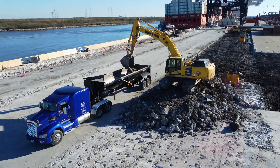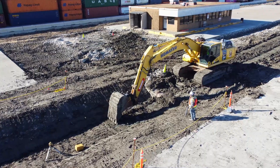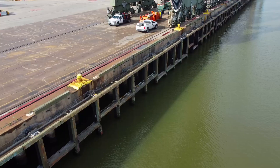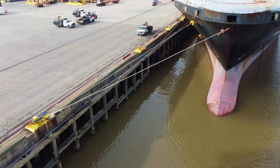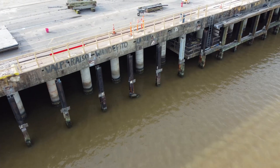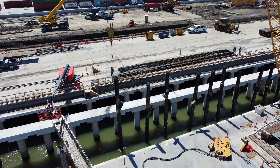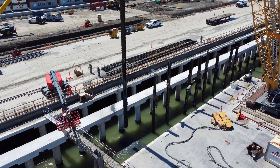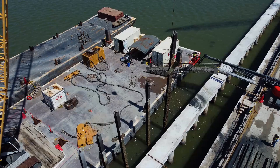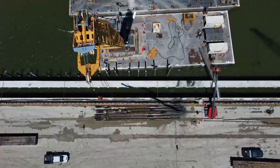On the landside, everything is much simpler since there is no water to deal with and no suspended deck. The pavement is demolished and a small trench for the new line of piles is dug. Next, we need to demolish the existing fender system. There are many designs of fender systems, and this wharf was utilizing a pile-based standalone system – essentially a steel frame with wooden blocks mounted to deep piles, with the whole system chained to the wharf for balance. The fender is separated from the concrete wharf face by rubber elements that absorb energy as the ship moves. The frame gets dismounted and removed, and the piles are pulled out by crane. The new wharf will utilize a different type of fender system, so the old system is fully removed.